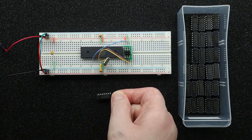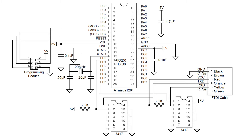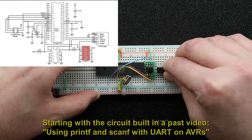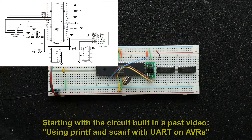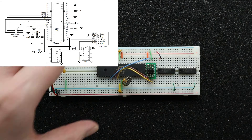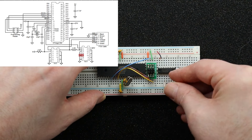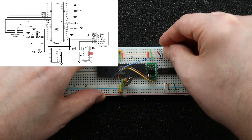So, let's connect up a couple of the 7417 chips, and here's the new schematic for this. Notice that I terminated all the unused inputs on the 7417s to ground — don't just leave them floating. One thing to consider is to add a bypass capacitor on the power pins of the 7417s. A 0.1uF to ground would be good. Even though I haven't added any, it is a good idea, and be sure to add them as close to the power pins as possible.